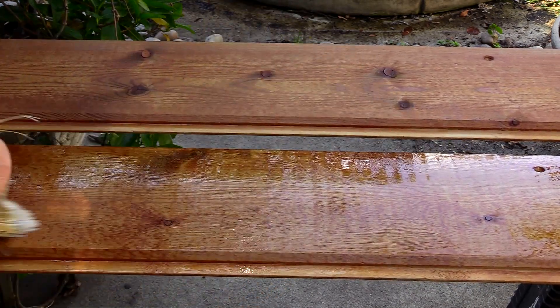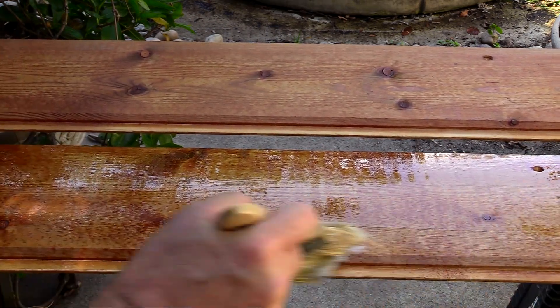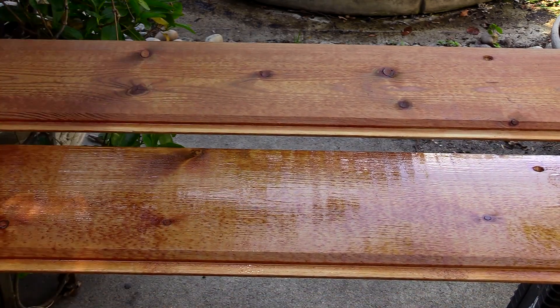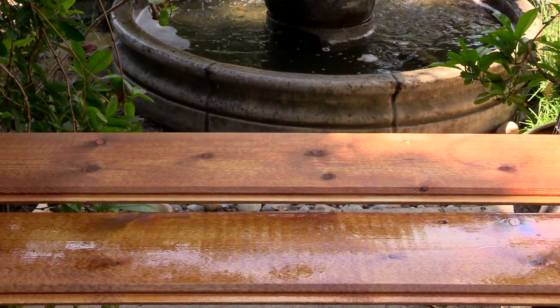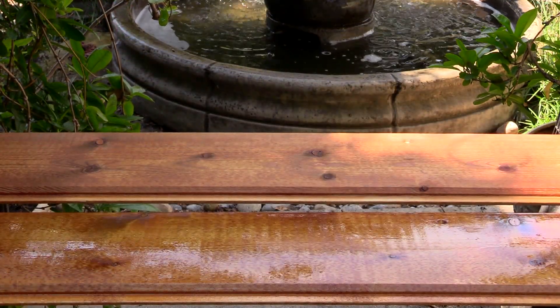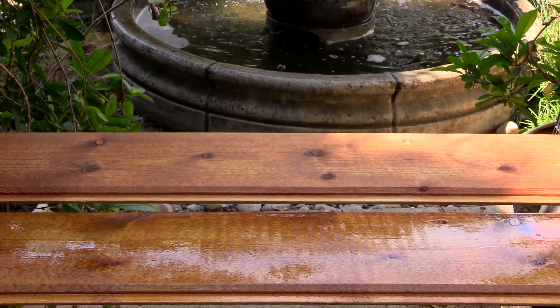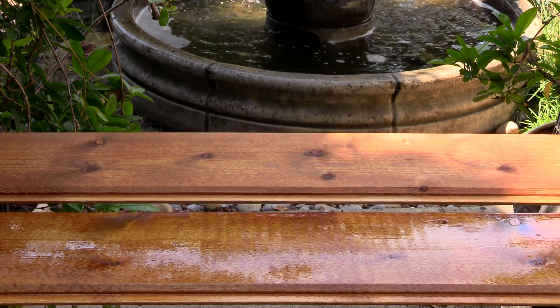This has a varnish built into the oils — it penetrates deeply and then dries down low. Using a clean cloth for the wipe-off — it's been 15 minutes since the second coat and the final coat is on. I'm going to go ahead and rub off this area and let you see the results. You can see the wood has definitely gotten a lot richer.